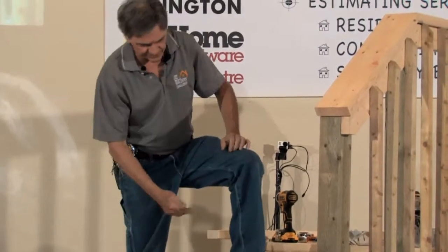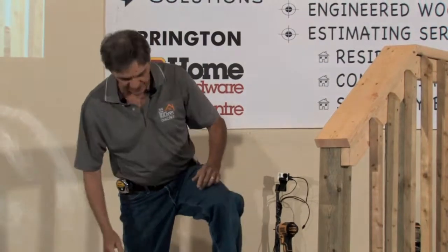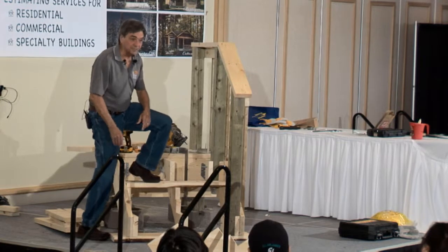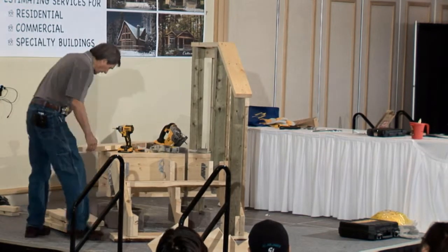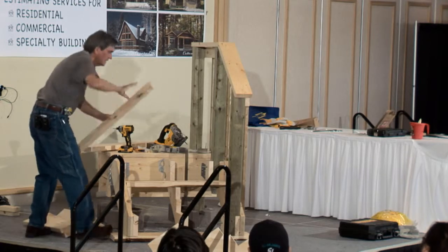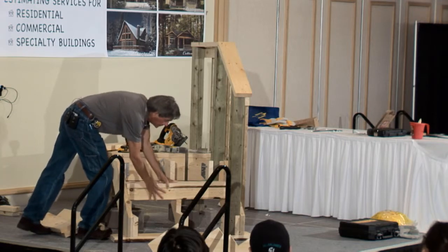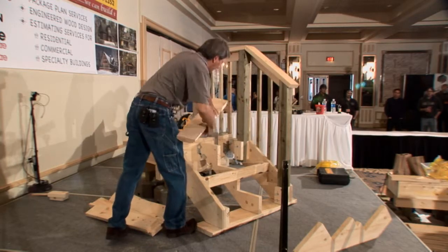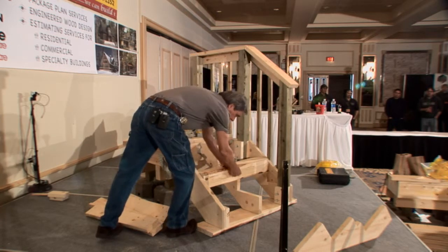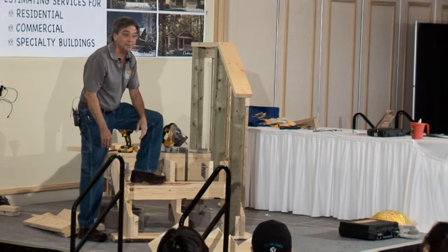and you go to walking on, now this is really a pretty close arrangement. It's pretty strong the way it is. But you can imagine if you go out to the limit as to how far you can spread, you can get a little movement on this one at some point. Well, a way to reach for your steps is to put a riser in, because the riser gives it more strength. When you come across on the top, let's put this around with a better edge on here. Let's turn this over. You see how this sits on here and gives you a lot more strength in terms of walking up and down.